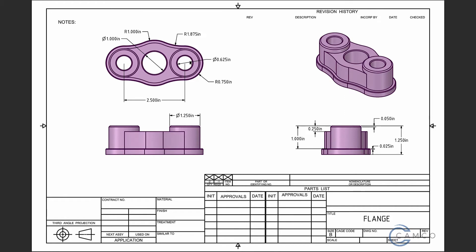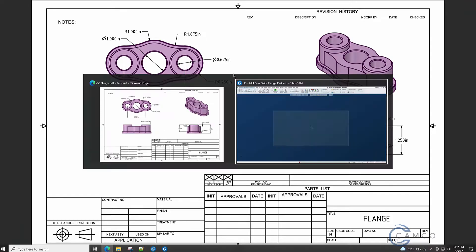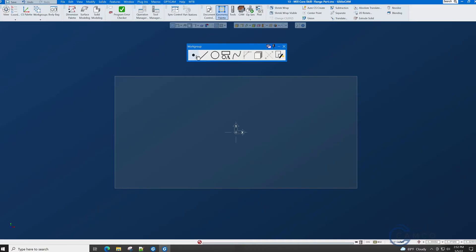Let's go to Gibbs CAM and draw the center points of these three circles first. The first hole that we will draw will be, of course, the center point of the first hole. We're going to put that right in the middle of the part. That is geometry palette, point, explicit. X0, Y0, Z0. This is the Do It button — there is a point there. If it's hard to see, turn off your coordinate system marker. We will leave the coordinate system marker off for the rest of this lesson since we will be working in three-axis vertical mill.